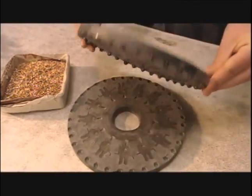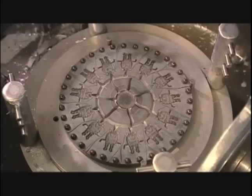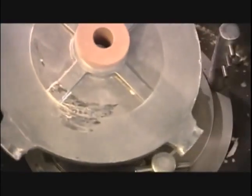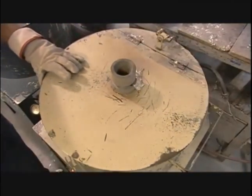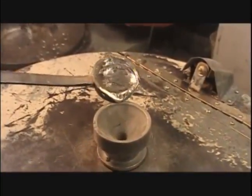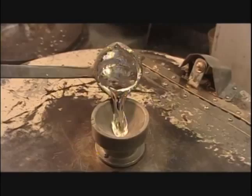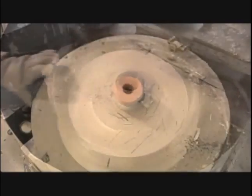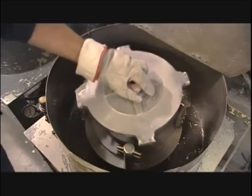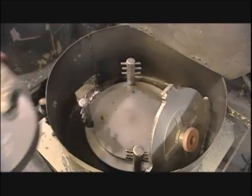Now, to close the mold, they align the buttons on one half with the depressions in the other half. The mold then goes into what's called the spin casting machine. Using a cast iron ladle that can withstand the fiery temperature, they pour in molten metal — either pewter, zinc, or a tin alloy. As the machine spins, centrifugal force propels the metal into every nook and cranny of the cavities. After a minute of spinning — 400 rotations — the mold comes out. The metal takes about five minutes to cool and harden.